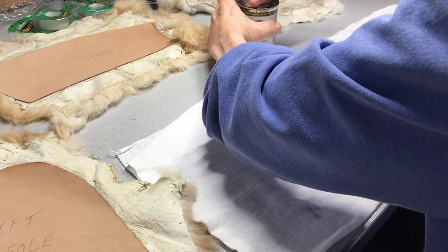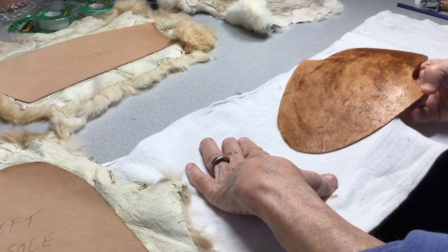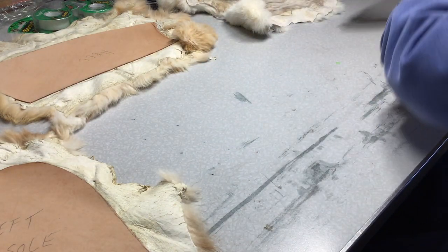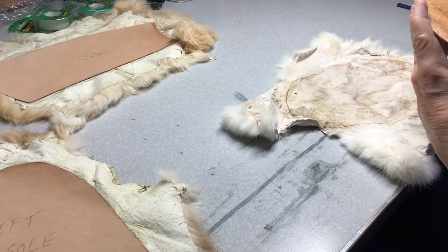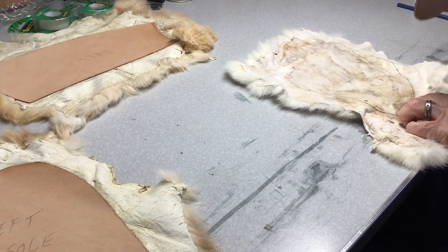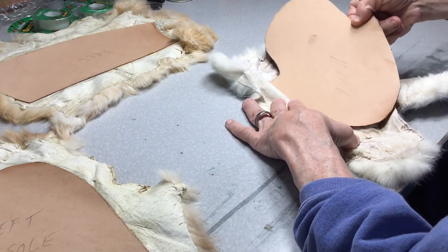All right, I'm going to seal up the rubber cement, get it out of the way because we're done with it. Now you see what I mean about when it's getting tacky. If you put it on too early, or if you try to bond the pieces too early, don't get me wrong, it will eventually seal, but you'll have far better success if you wait and let it get a little bit tacky, at least on one surface. See, I can pretty much touch that now and not stick to it. But when this other side gets mated to it, then it's going to stick big time.